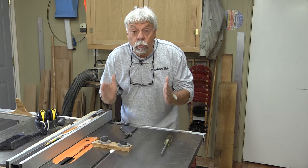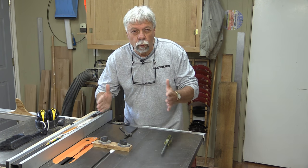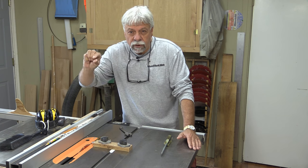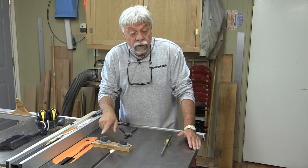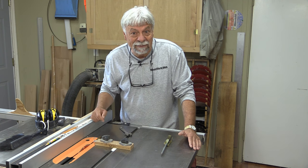What's going to make our box really rigid is when I glue the bottom on — that'll really keep it from moving around. But to do that I need to run some thin strips around the bottom of the box, then I can drop the base onto it. To cut those thin strips I've got my thin strip guide here on the table saw.